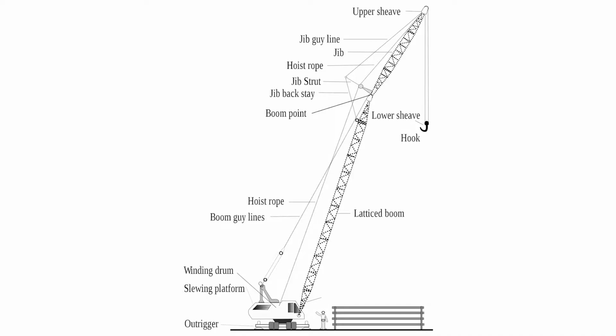When would you want to use this design? They're best suited for applications where the cylinder must pivot through an arc as it extends and retracts, such as with a boom crane or a bin tipper. Also, it is important to remember that clevis mounts require attention when being applied, because they're highly prone to side load and column strength issues.